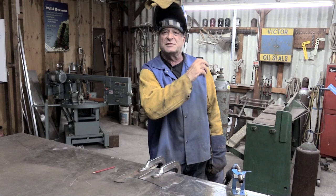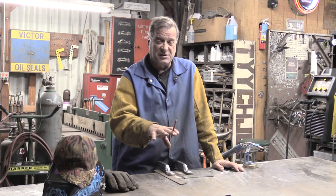This is really helpful also with TIG - it's imperative really with TIG. You've got to have that little bit of pre-flow there to help flush the line, get your inert gas down there so it can do its job, so the welder can do its job and everything comes out looking nice.